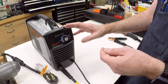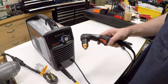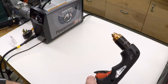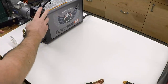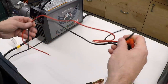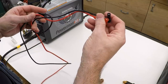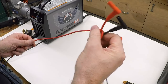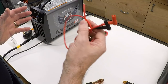The second risk is that this machine produces a high-voltage output that is normally safely contained within the torch — the only dangerous point is the tip where the fire comes out. But we're going to be bringing that high voltage out of the case on these probe wires, and this thing will happily establish an arc across the ends of them. So we're creating another point where that voltage could escape and cause serious problems.